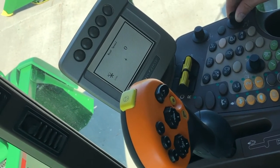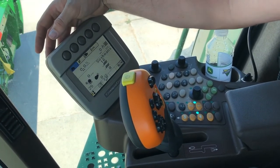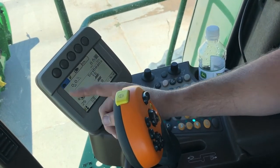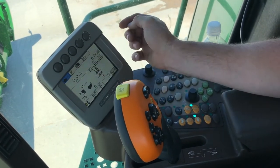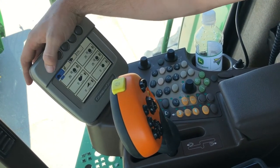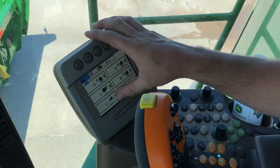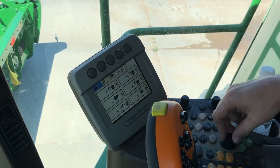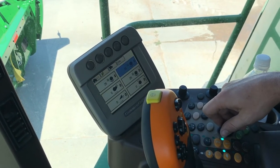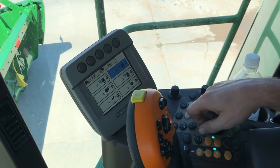All of these are going to show up a prompt on the screen. Now we're going to run through some of the buttons on our command center display in our 70 series combine. We can see as we navigate through the display, we've got these buttons across the top that correspond with these buttons down here. So we're on home page one of two. If we push this button, it takes us to our readings page, which is basically just going to show us what all of these settings are. We can use our scroll wheel on the armrest and the check mark to click through those, and we could use the check mark to change what we're seeing on the second home page as well.